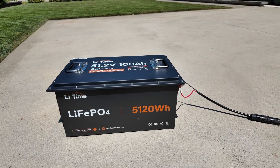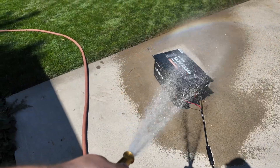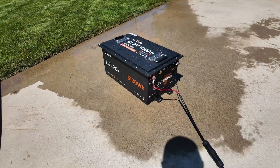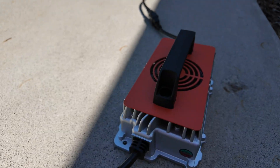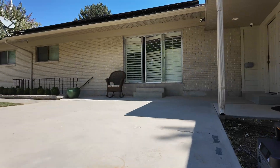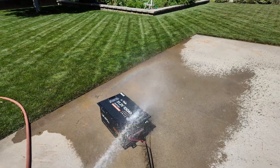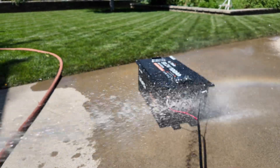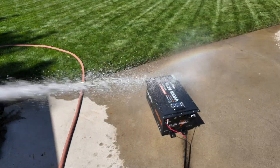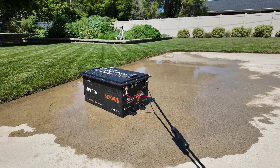LeeTime claims this battery is IP66 water resistant — in other words, hurricane-proof — so let's give it the good old hose test. I've actually got it connected up with a waterproof charger running on it, and you can see it's flashing red, meaning it's currently charging. Let's hit it good with some water — getting these contacts good and wet. This end of the battery is where it's the weakest, with the ports, vents, and all the penetrations; we'll get around these screws really well too. You can see the charger is still running, so no harm, no foul as far as the BMS is concerned. Let's open it up and see what kind of water got in — hopefully none.